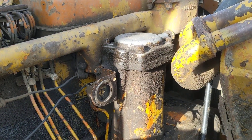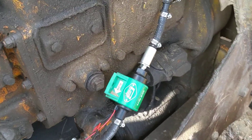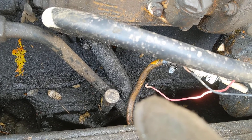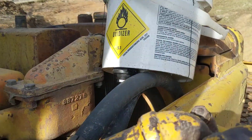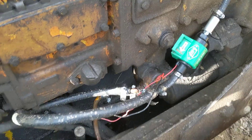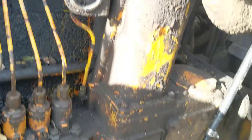So what I ended up doing was finding a low-pressure diesel pump — about four to seven PSI. I had to cut my hard line coming from the back and plumbed in this little line right here, with a small maybe three-gallon bucket up above so it would drain straight into the tank. I hooked this up to my batteries and just started letting it run.